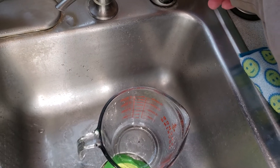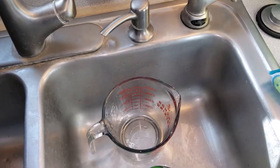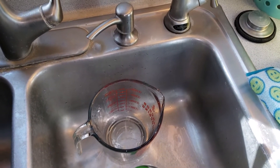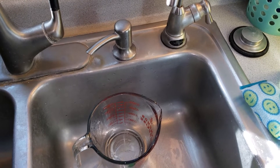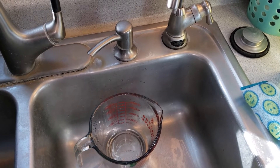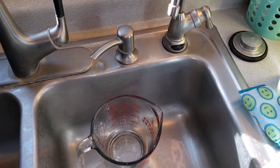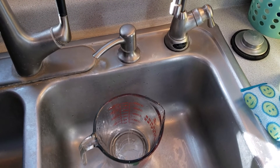After a few hours — let's see how fast this comes out now. I wouldn't expect the whole tank to be fully charged just yet; probably overnight it'll be fully charged, and tomorrow morning the flow should come out pretty good. Other factors that affect production come down to temperature. Right now it's kind of chilly in the basement, and with the system mounted on an external wall it's probably around 50°F. Most reverse osmosis systems rate their flow at about 70 to 80°F, so when it says you should be producing a certain amount of water per minute or per hour, that's at a higher temperature — a colder temperature will result in less being produced.